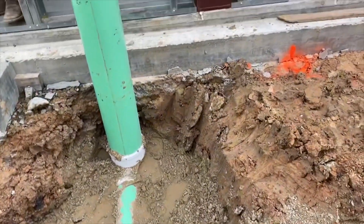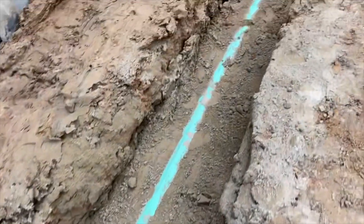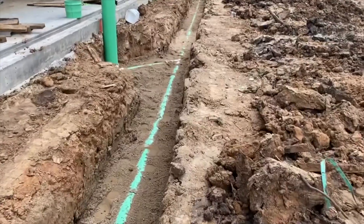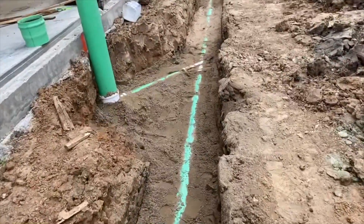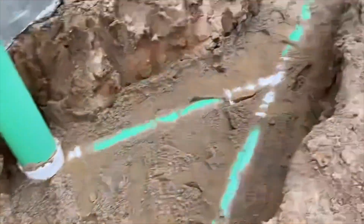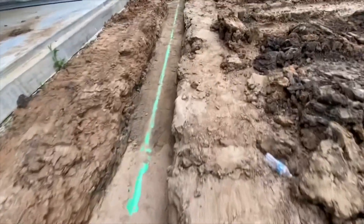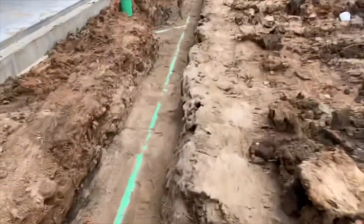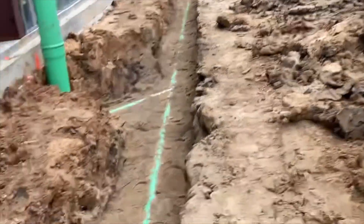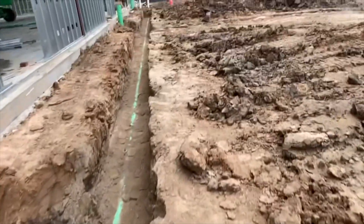Earlier I spoke about turning your writing up — this is why. Now this is backfilled with stabilizer sand. If you look down the center real closely, that's the writing. We are ready for inspection. The reason we backfill it like this: if we get any rain overnight and this didn't have something on it, it would float up and all your work would be destroyed. This way the inspector can see every joint. He can see every piece of writing — he knows the material, he knows what he's looking at.